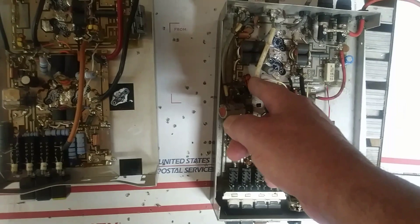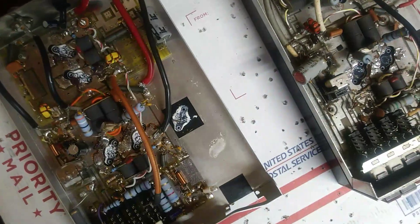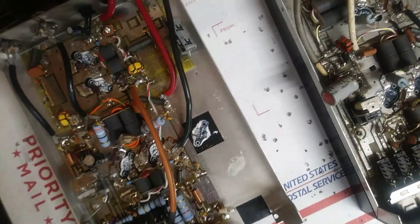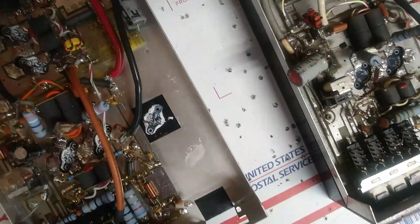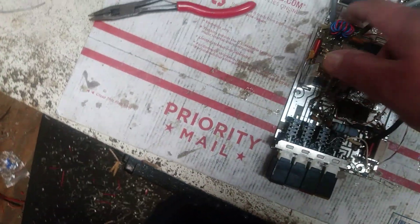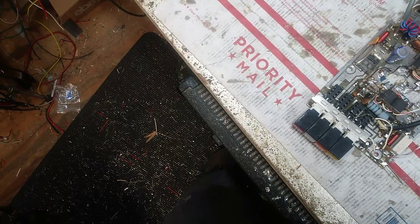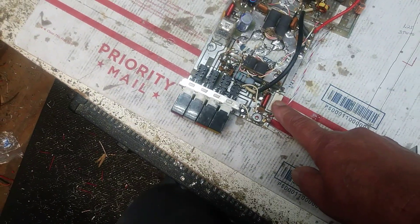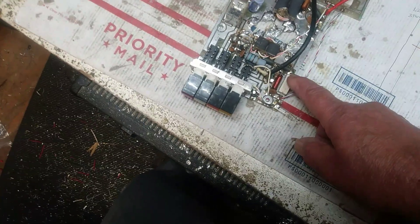I've got a combiner right here. I believe I have a metal clad — 667 has a metal clad here. The 500 has a DM15 output cap. It calls for 91 but they are 100 — I'm going to put a metal clad in here, between here and there, just so it stays stable. I can hack the bias out of here, because as this resistor goes, the bias shoots up like crazy and it is a pill killer.